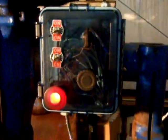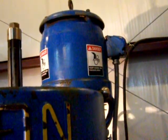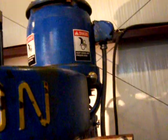This is my control box for the VFD remote controls. I got the VFDs in this box down here. I got one up top right there and a little one down there. This one right here is for the main motor. It's a 3 horse and it's actually a 2-speed — I'm only using the high speed because I'm using the VFD and I don't need the low speed.